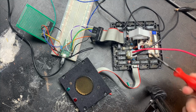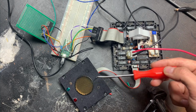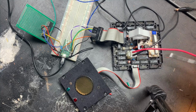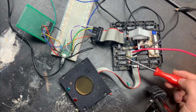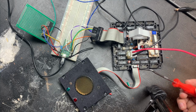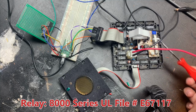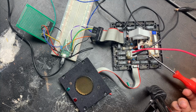Essentially you have this kind of tan colored daughter board up top, and that's what generates the pulse that goes to the sonar module and reads the signal that comes back. So that board, there's only one of it, and there's 16 sonars all around the circumference of the robot. So these little smaller chips, here, here, here, and all around, there's one per header, and those are all relays. So one and only one of them is closed at a time, connecting one transducer at a time to the sonar board right here. These two longer chips are what does the multiplexing.